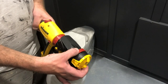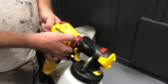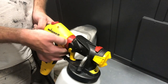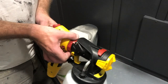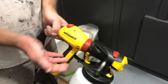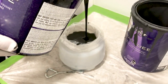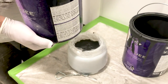The red spray width lever allows you to choose between a wide or a narrow spray pattern. Since we were painting an entire room, we chose the wide option. The next option to adjust is the material flow control. Again, you'll want to reference your manual for the material settings guide because the setting depends on how viscous your fluid is. You can spray anything from thin stains and sealers to oil or latex paints, and since we were spraying a paint and primer in one, we chose setting 11 and it worked perfectly.